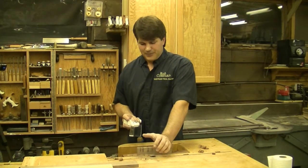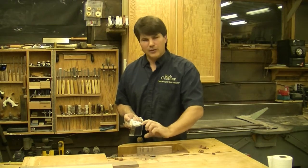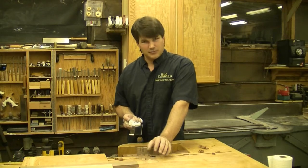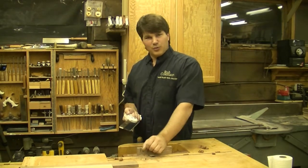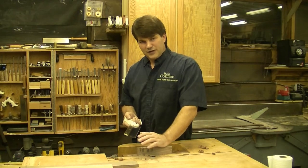As far as maintenance goes, if you have a moisture problem in your shop or in the area that you live, you may want to keep a light coat of oil on the saw between uses just to keep the rust away. As far as sharpening, remember this is a joinery saw — don't be using it to cut the end off of a board. This is just for your fine joinery. That way you can get a long life out of a sharpening.